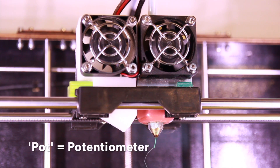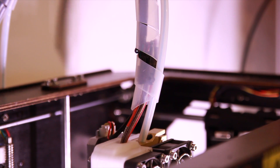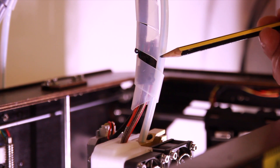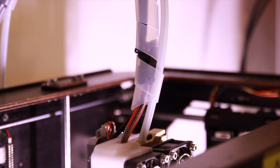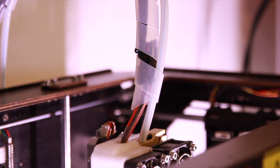I even checked the part controlling the servo to see if it was drawing enough current — everything was fine. After some despair thinking I'd bought a bad printer, there was one last component I hadn't checked: this clear tube. Originally it came with a black tube — just some generic cheap plastic — and the white replacement is PTFE, the same material used on frying pans; it's non-stick with a very low coefficient of friction. The PLA going through that black tube was causing a lot of friction around the bend. As soon as I replaced it, my problems were over and it was producing really high-end prints. Everything was running smoothly.